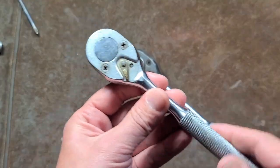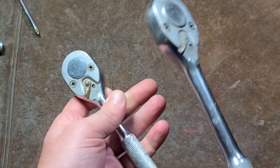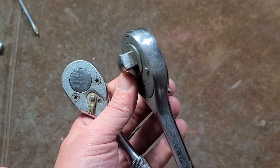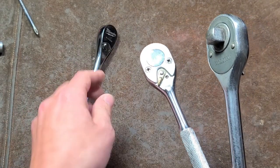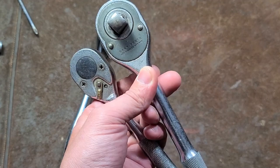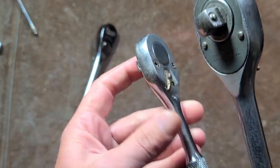You find these because they look just like any old cheap ratchet in the junk bin. And that's kind of the point of this video — these 49 series ratchets were Proto's basic edition. There's all this talk about tooth counts; we have this Milwaukee which has turned out pretty well at 90 tooth. These are 24 tooth — extremely coarse ratchets with pretty wobbly anvils. These were just basic Proto ratchets.